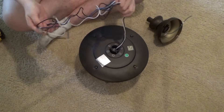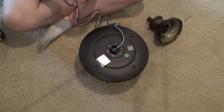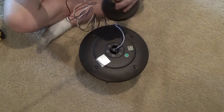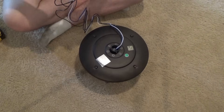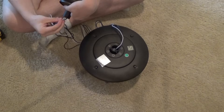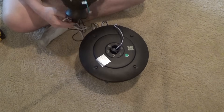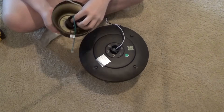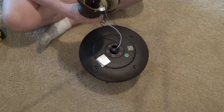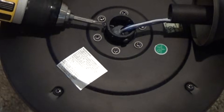Remove the rubber band or wire tie holding your wires together. This one has three wires — if you just have a standard ceiling fan it may only have two; that third wire is for the light kit. If you don't have a light kit, simply expect to see only two wires. Once you get the wires freed, you're going to feed them through in the direction of the smaller canopy so they come out the top with the green ground wire. Pull them through because the next step is getting this down rod attached to the fan motor.